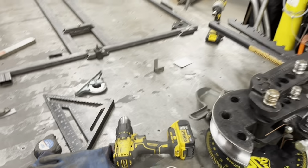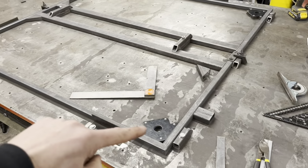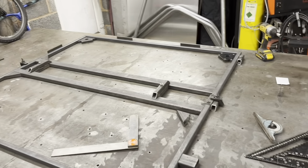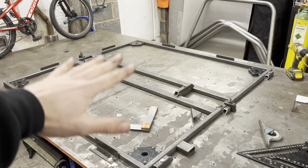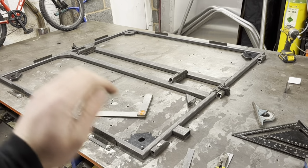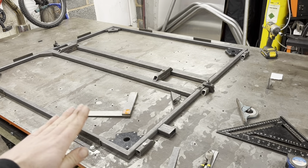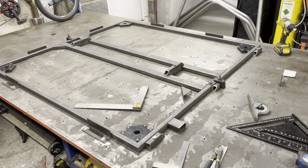Weld prep. We'll go through the weld prep anyway in another video. So all this is just a test fit. And then it's all going to come apart, all cleaned, all chamfered, prepped, nice, secured. This has got to be clamped down very well because whatever we weld first, we will weld this. This is actually the bottom of the car. Yeah? So all this has got to be welded and then linished back flat. Yeah? So we've got to get the weld really deep into its core because we're going to weld it flat. Because otherwise, when we flip it over, it won't sit on the table flat. And also, when you put your alley floor on, it's just going to be nice and flat.